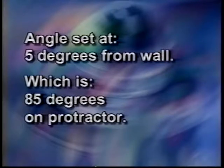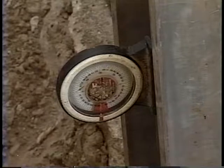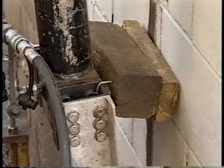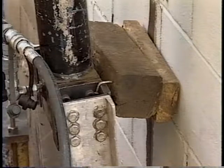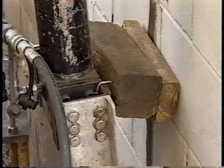If you do not have a five-degree angle, place your foot against the bracket to keep it tight against the face of the footing, and then push or pull the hydraulic ram in the direction you need to change the angle. Once again, put pressure on the bracket against the bottom of the footing and check the angle of the starter tube. You may need to repeat this procedure several times. Once you have set the five-degree angle, you will need to set bracing — two-by-fours, four-by-fours, or one-by-fours — between the hydraulic ram and the foundation wall to maintain the five-degree angle while pushing the rest of the starter tube and the remainder of the tubes.